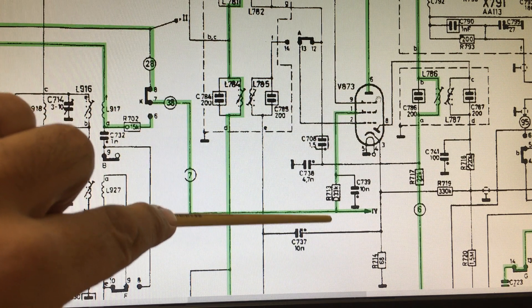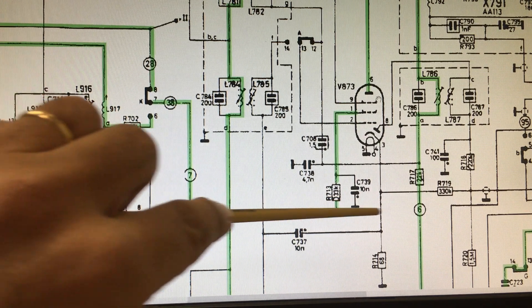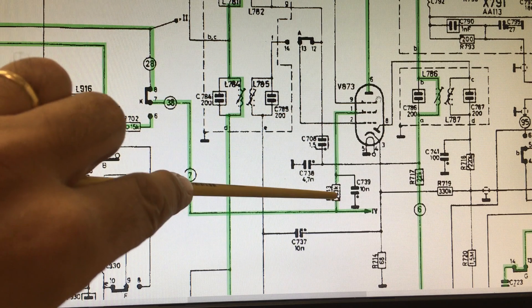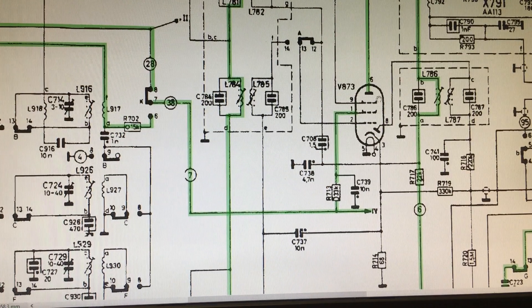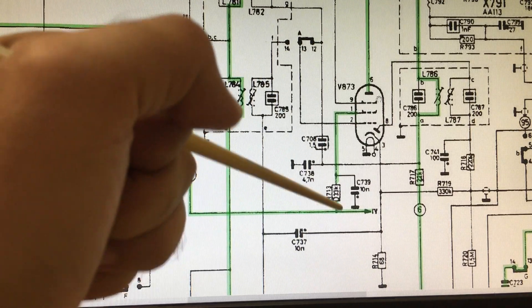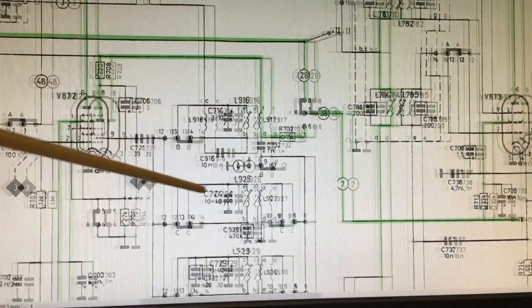When you're on the tube you might as well check some other connections. This is another B-plus line, a B3-plus, and I measure that through there and it says 33k — but I actually get 22k, if I recall correctly. This may not be wrong, so I need to check what the markings are on the resistor. The reason I say it may not be wrong is that these schematics are not exact — some of these are for different iterations of the model. So if I look for this resistor and it says 33k but I've been measuring 22k, then I know that resistor has got to be replaced. I've actually marked the connections to it but haven't painted through it, which means it still needs checking.